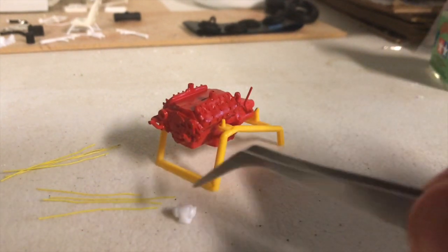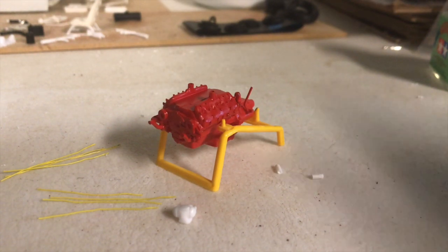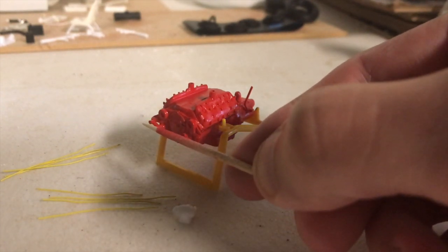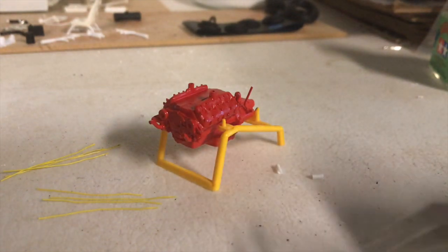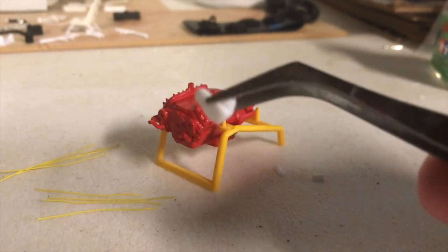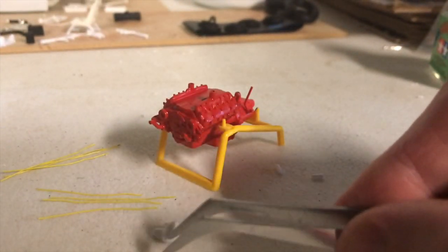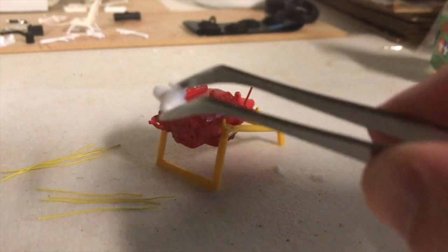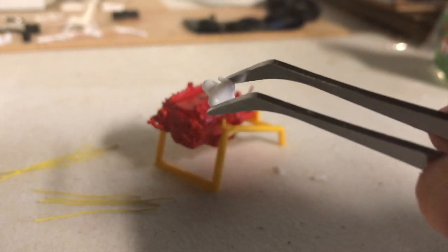but basically these lower radiator hoses, my distributor was sticking out further than these radiator hoses, and the radiator hoses butt straight up to the radiator. So what I ended up having to do was, I don't know if you can see this good or not, but I ended up having to sand down the back of my distributor to get the distributor to sit closer to the body. So a little bit of a cheat there, but otherwise it would have hit the radiator. So I had to do a little bit of modification to my distributor. You may not have that issue or that situation, but I did.